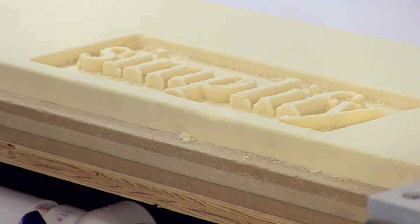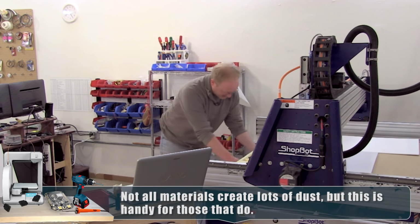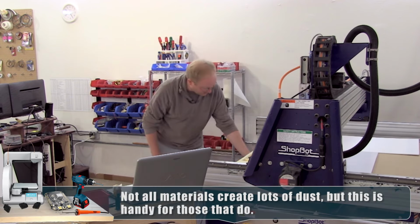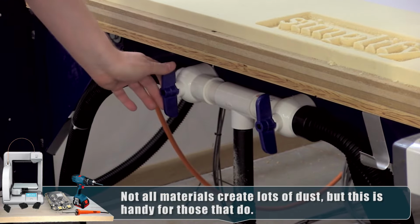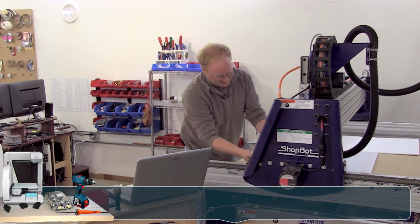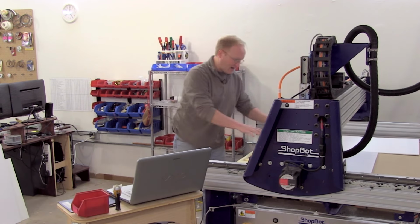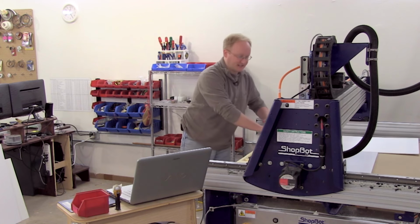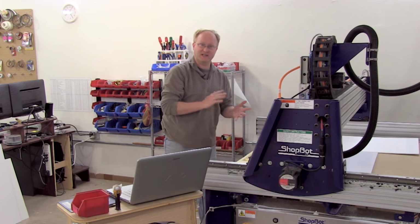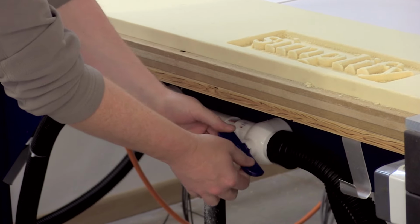So what I realized with the knobs is you have to have a balance. You don't wanna have them both off, but you usually want the chip suction to be all the way on because these fins are loose. It's never gonna have a perfect seal. Whereas your vacuum table, it's really easy to cover up all of the holes and get a really good seal. So I was able to have that only at about half.